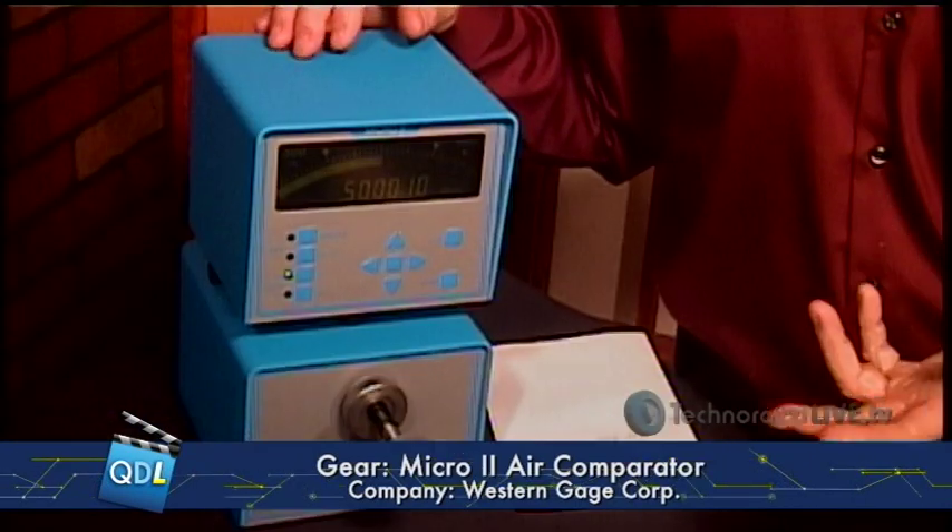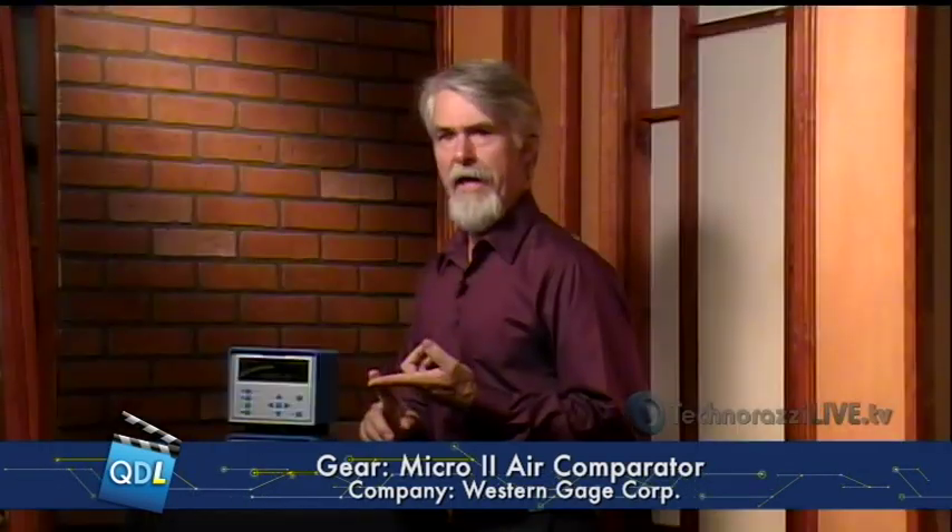Another option on this particular unit is an RS-232 output. If I press the print button, I can output my latest reading to a printer, or actually send it to a laptop for further data collection. So it cleans the part and it's easy to use. Air gauges are seen a lot in shops because they are very easy to use, and also they're relatively affordable. This particular box is a little under $2,000 — $1,985 list. If you think about getting a good high-quality micrometer or caliper and a set of gauge blocks or a height gauge, you're easily up to that amount of money already, and those require a certain amount of skill from the operator. For a shop that needs to do go/no-go tests really quickly, air gauging is really the way to go.